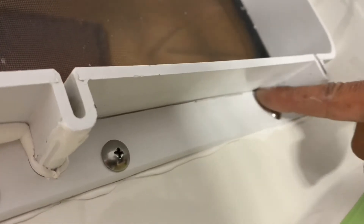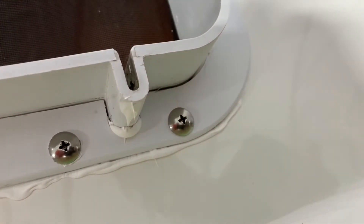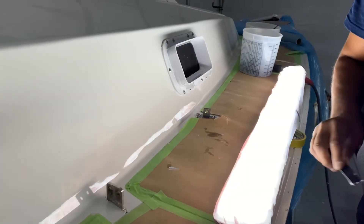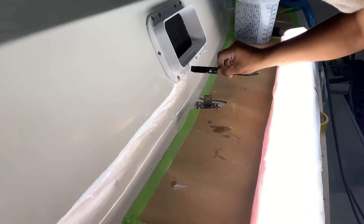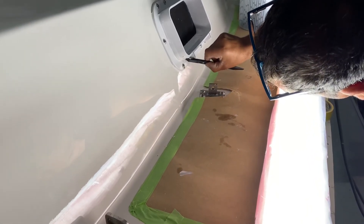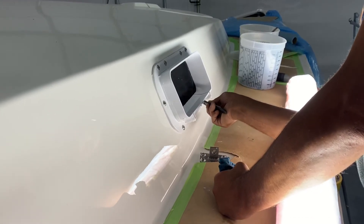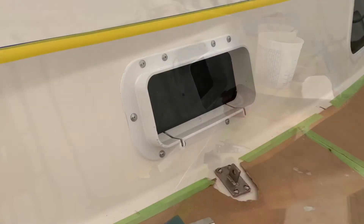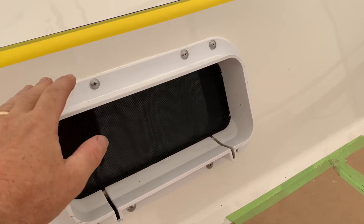All right, let's get this in. We actually got the window in from the inside, and the flange on the outside — we put these screws on so we can hold the flange in place. Normally with these windows they just glue them with sealant and they never stick, so most likely you're going to get water penetration from in here. Although I put all that caulking on the flange, you can see where it's still dry — no caulking in there — so I'm going to inject some caulking in there. You can see around the side it's oozed out nicely, so you know you've got a good seal around the bottom. There's a little missing here in this area — this whole cavity — so now we're going to backfill all that to get a nice seal, then clean it all up with the glazing tool.